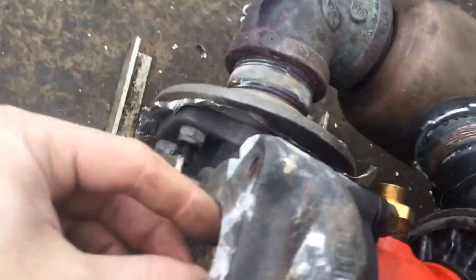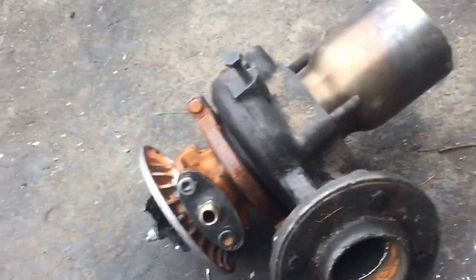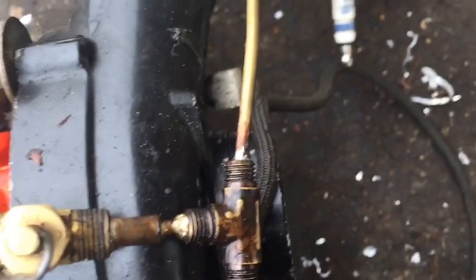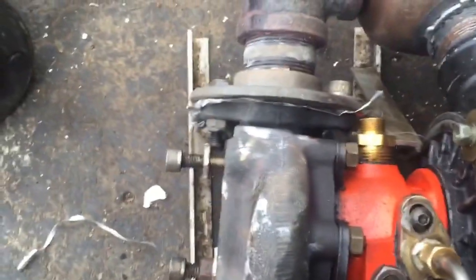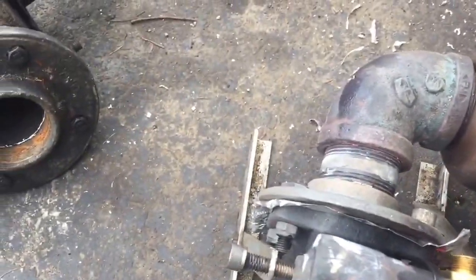The exhaust gas is going to be forced out and spin the high-pressure turbine here. And then the exhaust from that is going to go into the low-pressure turbine here, which is then going to feed the low-pressure compressor, which is then going to feed the high-pressure compressor again. So it's going to be a continuous sort of cycle — that's how a jet engine works. But it's going to be a twin spool engine, kind of like what real airplanes use.